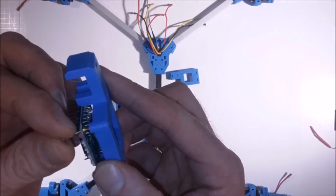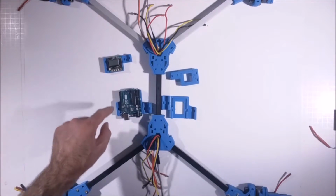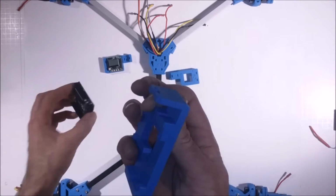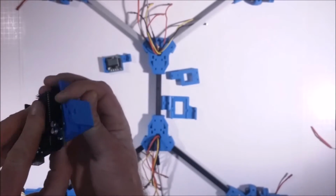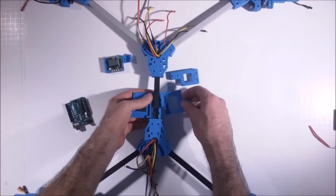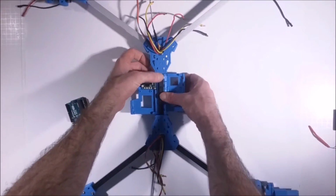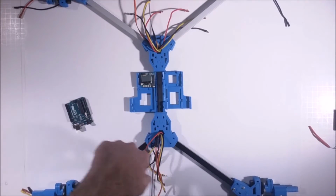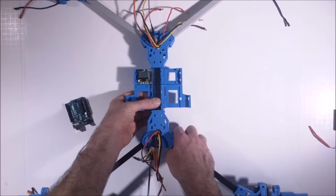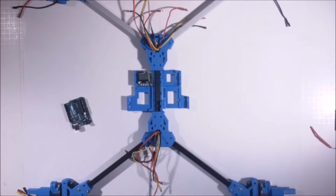So now we'll take our servo screw and thread it into that hole. So we do that 1, 2, 3, 4. This side here, it goes onto more plastic little nipple pieces that go through there as well. So put that all in there, and then we're going to slip all those pieces onto there. So you can see later if you start using different components, just design a new piece to fit onto this bar. And we can even extend the bar and put more components, whatever.